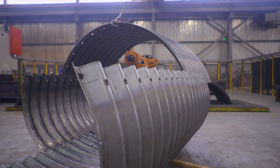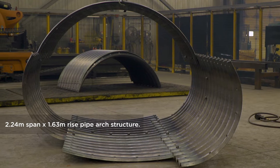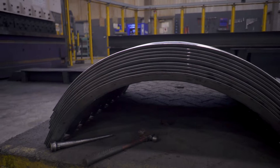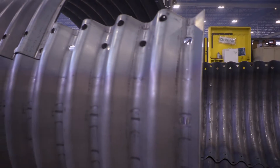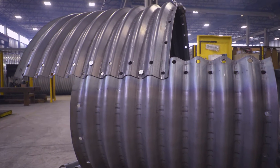Today we're going to show an example assembly of a multi-plate pipe arch with a 2.24 meter span by 1.63 meter rise. This structure is using modern style plate with four foot wide rings. Each ring is made from four plates: a 5n invert bottom plate, two 5n corner plates one on each side, and an 11n crown plate on the top.